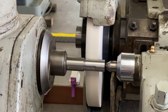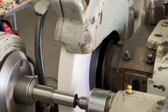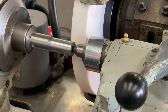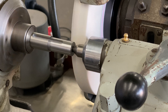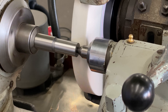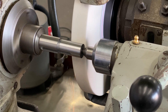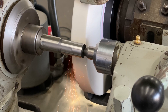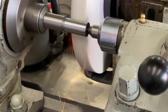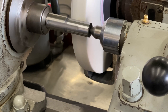We're just getting this cleaned up really nice and on target so it'll go into our Moore collet — no threaded connection — and minimize the concentricity errors of other methods. This one's not perfect by any means, but we'll have a much better concentric piece. Not only the place where the gear-cutting arbor goes has been ground on this same set of centers, but the part that goes into the Moore arbor is ground too. We could grind between centers on both ends to improve this further. We could also grind all these surfaces and do the threading last — the threading is very inconsequential from a runout standpoint, as we're just using it to put pressure on the piece. Everything gets important when you're trying to work to higher tolerances, and that's why it all costs more — you need equipment like this.